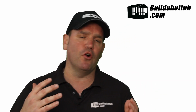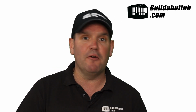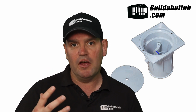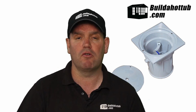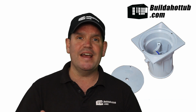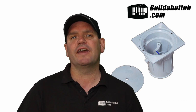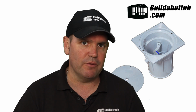Okay, so auto top-ups or auto fills come in many different shapes and forms. Now there's definitely retrofit models that you can get. There's standalone models, just like this behind me here. So this looks a bit more like its own kind of skimmer system. It's about the size of a skimmer, and it has the auto top-up system. You would put that into the concrete, obviously before you poured your pool or your hot tub. It's not a retrofit system, but it is a standalone system. Now for me, I think these in this form are a little bit of an overkill, and I much prefer the auto top-up systems that are integrated into a skimmer.